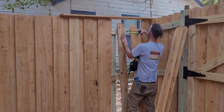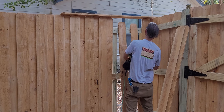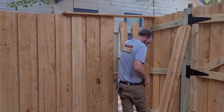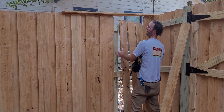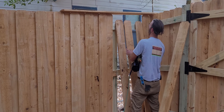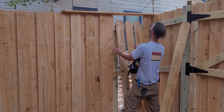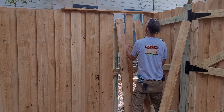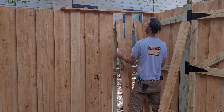There are four inches between each board. I think we're going to need to do a third one right here at the very end — this is the corner, so what I'm going to do is just split the difference on each one with a two-by-four, making sure that distance is all the same. I'm going to tack the middle in right here — boom, one right in the middle. I'll split the difference right here.